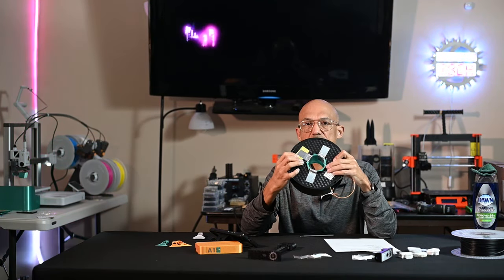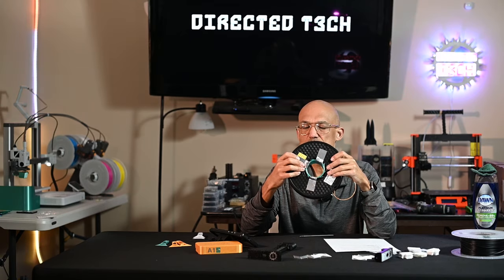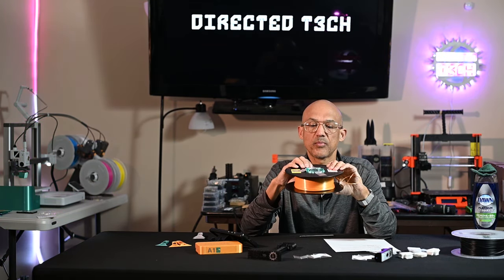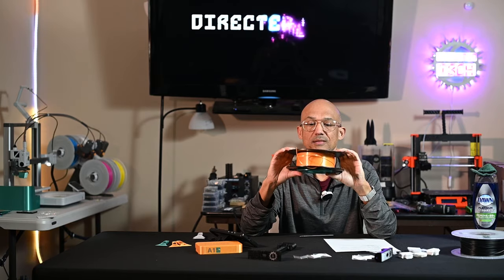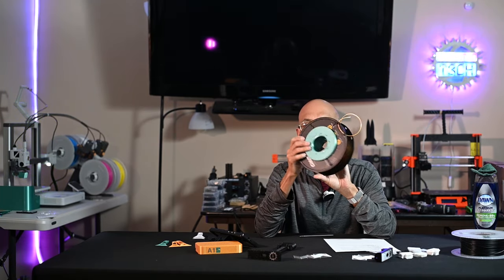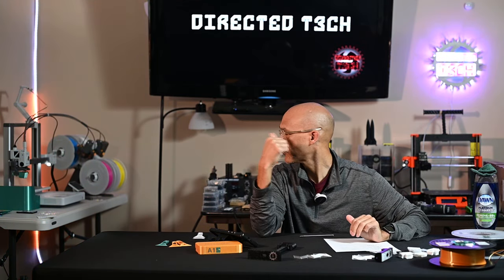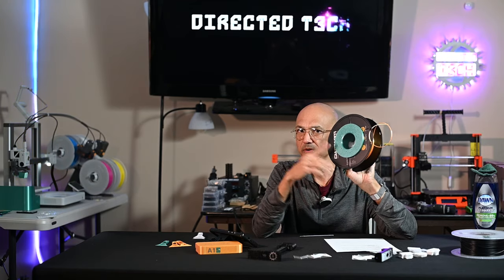This particular design has tabs that come out the side — they're flared and compressible. It was still a little too small for my particular spool, so I got some foil tape and threw it on there, and it's going to be more than fine. When I'm done with the spool I can take that tape off, take out my spool adapter, and use it on the next one. Primarily for me, Overture cardboard spools work great and fit right on. But if you have something that doesn't quite fit, print yourself a spool adapter — that's tip number four.